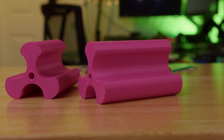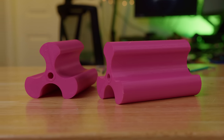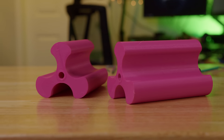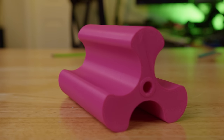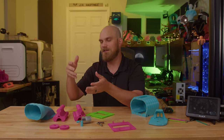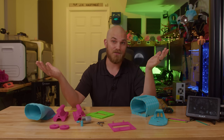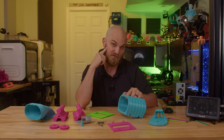The next thing I tackled were the rotors. There were two choices — roots or twin screw — and I decided to go with roots because it looked more like the picture. I went with straight lobes versus twisted lobes, mostly because it was easier to design and the print was super easy for this style rotor. That said, if you want me to design a twin screw or some twisted roots rotors, just let me know — I'd be happy to do it and we can see which one actually performs better.